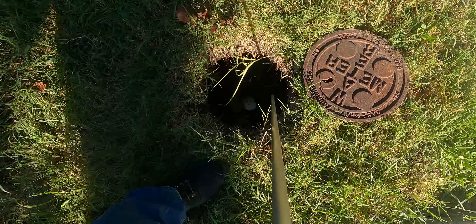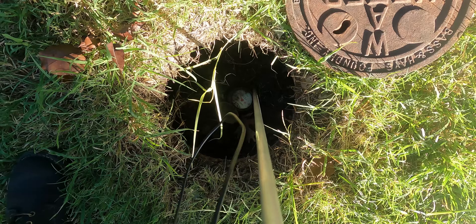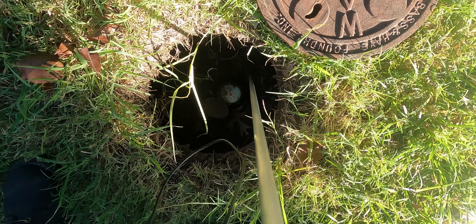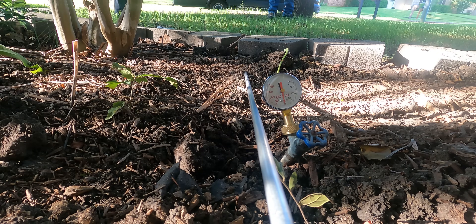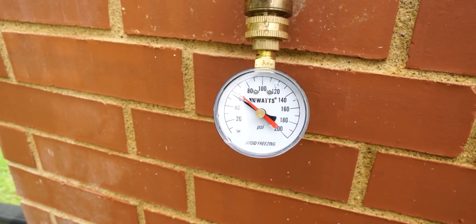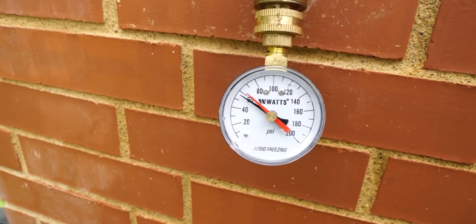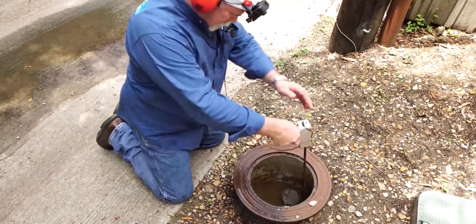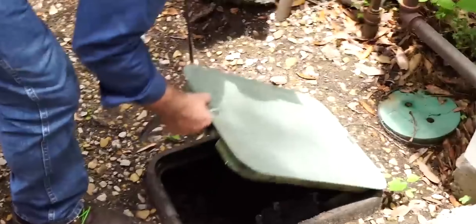The very first thing you do is start at the meter. If you've got good leak detection equipment, go ahead and put it on and listen to the meter. Is it making any noises? Is the dial turning? Is there any indication of a leak? If there's no indication but they're still getting a high water bill, you may want to put a gauge on the house. If you're out there for a water line leak and you know it, go ahead and put a gauge on the house, turn the meter off, and see if that gauge goes down. When it comes to water line detection, start listening right at the meter.